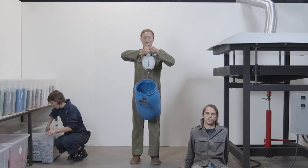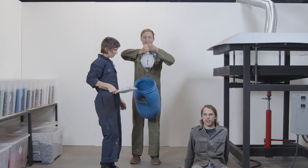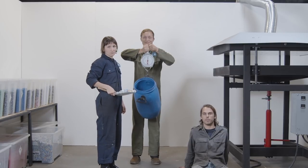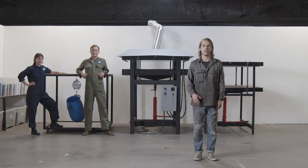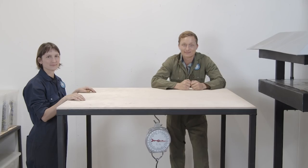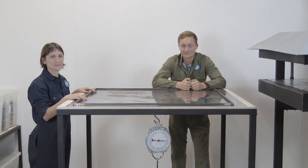Now it's time to make your first sheet. Different sheet thicknesses require different amounts of plastic, so it's good to weigh your plastic out beforehand to make sure you're using the right amount. Your plastic's measured, now you can prepare it for the hot press. A prep table next to the hot press makes it easy to set up before pressing. You'll also need a mold, which is just a simple square frame sandwiched between two steel sheets. Before you pour plastic into the mold, treat the mold with mold release to make it easier to remove the sheet once it's pressed. We found silicone oil works the best.